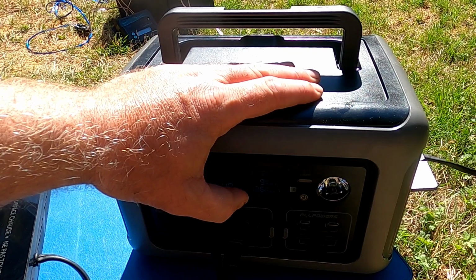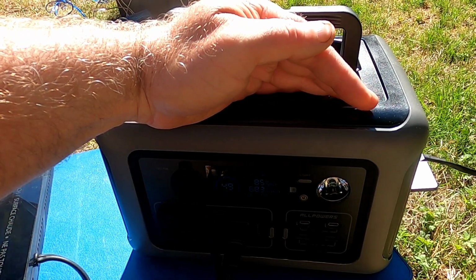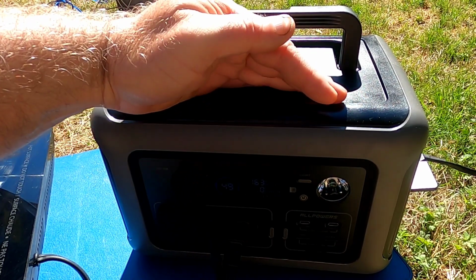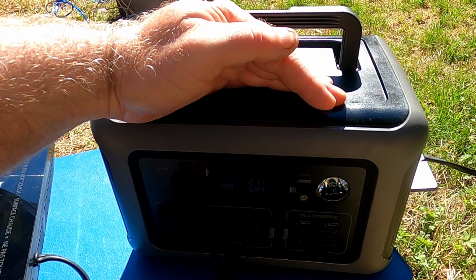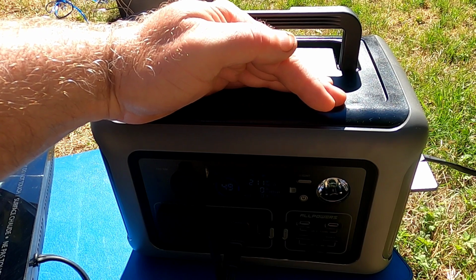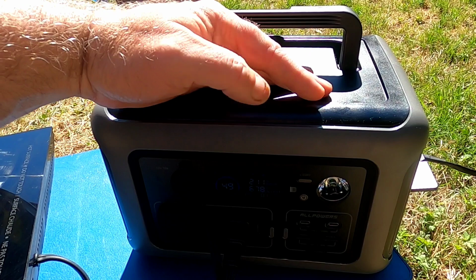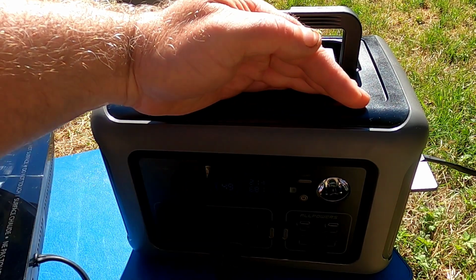And you'll see now with the watt output, because I've got it down on the lower power setting, this unit is now going to draw 684 watts, but then it turns on and off, and it does intermittent heating in order to get down to that 300 watts. So you're still using the inverter in this unit pretty hard in that regard, but it's turning on and shutting off every couple seconds to give that lower power draw, to give you an idea of what's happening there. And you can see that I've still got 49% of the power sitting in this generator.